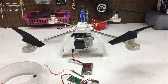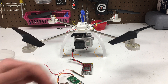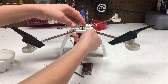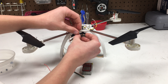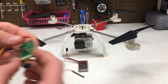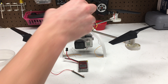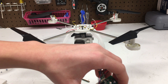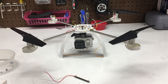What that means is I'm going to be using all the original functionality of this drone, meaning the camera and flight controller will be going back on. How it's looking right now is the camera going on first underneath with a little bit of sticky tape on the back, sticking it to the front as more of an FPV so we can have the GoPro up top. Then I'll put the battery tray upside down on top and screw it in loosely so the battery slides in, and hopefully mount the FC board on top of the battery with either sticky tape or the screw holes.